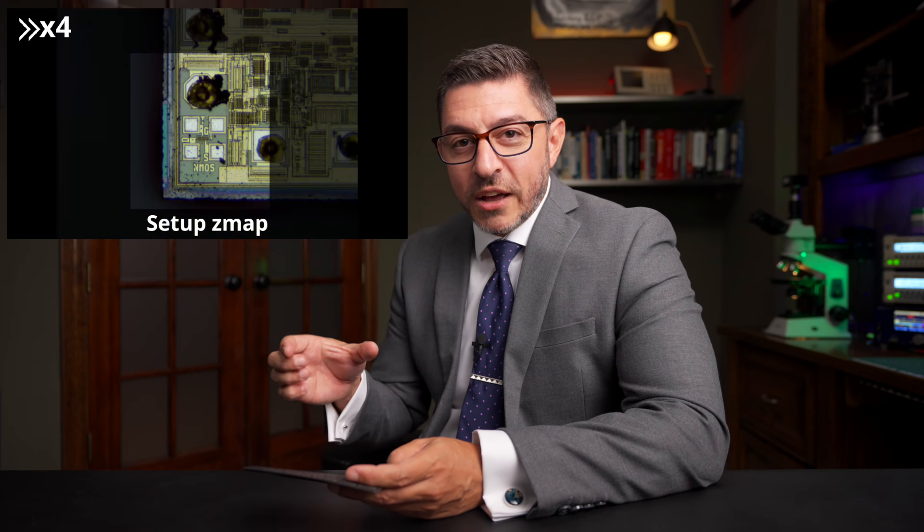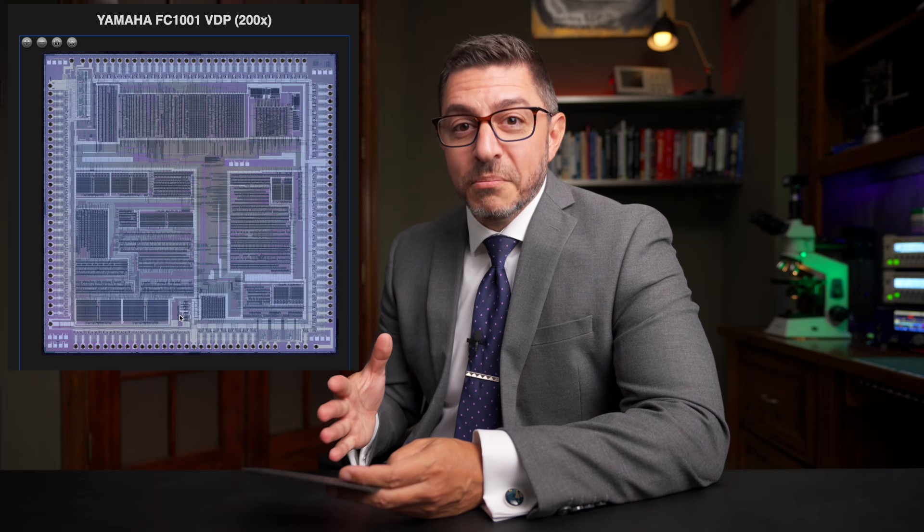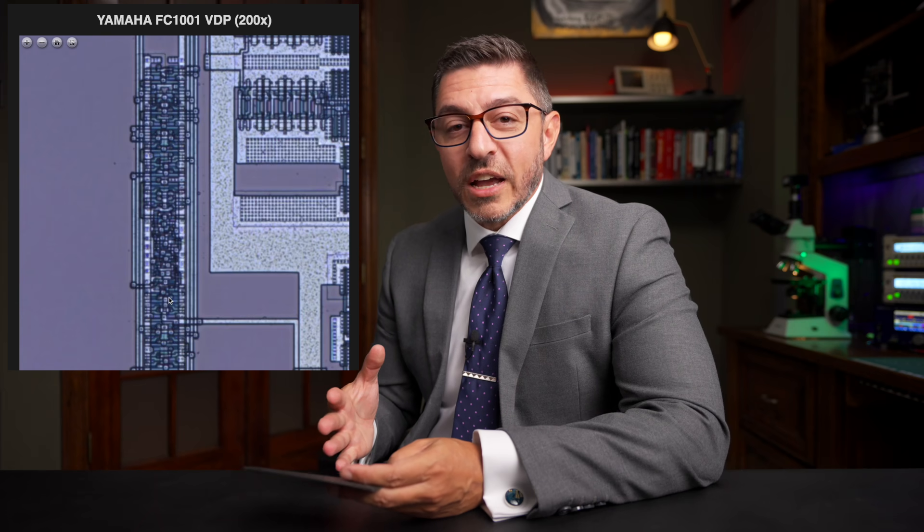He has Arduino code published as well that controls the whole setup and takes various inputs. One interesting piece buried in the middle of the page is that he came up with a cool way to only control one motor at a time — only one motor can be powered on at once — which means you can use a much smaller power supply because you're not driving three stepper motors simultaneously. Two stepper motors drive the XY stage, and then you have one that drives the focus so you can control it as the stage moves around, creating a map of where it needs to be focused based on the level of the different corners of the piece you're looking at. You should definitely check out his site. The silicon images on there are amazing — the detail is fantastic.